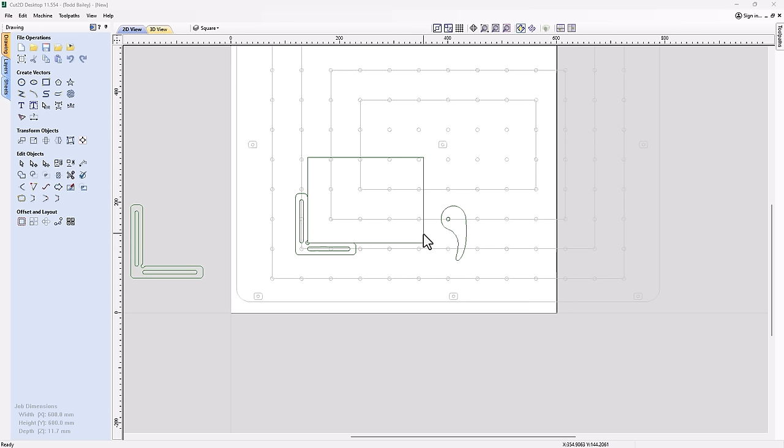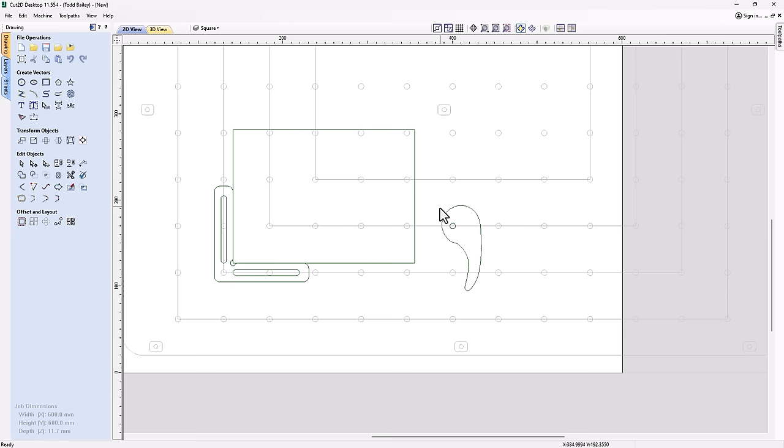Now, one thing that's different about this rectangle than the last time we saw it is I've made it a little bit shorter. That way we can illustrate this next part of the puzzle, which is what happens if we go ahead and try to use our cam, but it can't quite hit our material. What are we going to do? Well, that's when a little wedge will come in handy. And the wedge is exactly that. It's a really simple little wedge of material that we can jam in between our cam and our material to close that gap that we need.